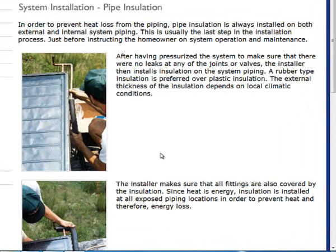When we look at the final wrap-up of our installation, we're going to look at pipe insulation. There are two predominant types. A closed cell foam, which uses a closed cell membrane that has a rubber-based feel to it — not quite rubber, but a much less spongy material. The other type, more prevalent at your local hardware store, is an open foam insulation, which feels more spongy in nature and generally comes in black or a light tan color.